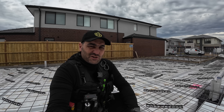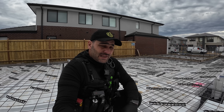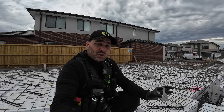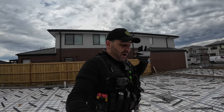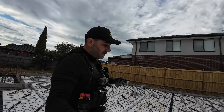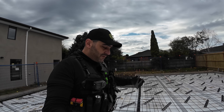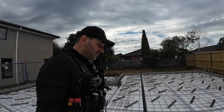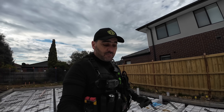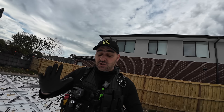We're doing an inspection today for a construction stage inspection, and this stage is called a slab stage inspection. We're inspecting this whole slab before it gets poured tomorrow. This is a waffle slab setup — basically you've got these polystyrene pods being installed, and we've got the mesh sitting on top of these bar chairs. We're going to assess the installation of the steel fabric as per the engineering to see if the slab setup is as per the engineering.